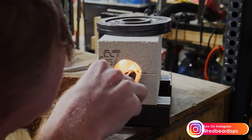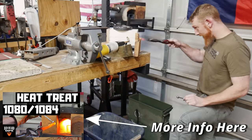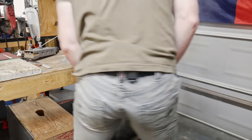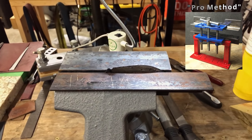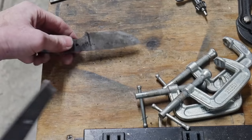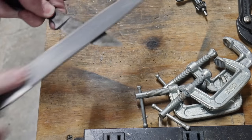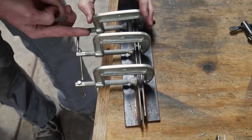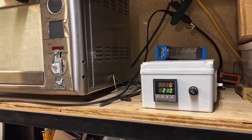To stick with the cheap nature of this knife build, I just used a pair of pliers to hold on to the tang of the knife. I'll get the knife up to a non-magnetic heat and then target around 100 to 200 degrees higher than non-magnetic temperature before quenching it in oil. You can use canola oil, but in this case I use Parks 50. I then clamped the knife between two pieces of angle iron in my vise after a four to five second quench — this ensures the knife cools in a straight orientation. To verify a hard blade, I will file test it to see if the file skates across the blade or digs in; if it digs in, the steel is softer than the file and something went wrong during heat treatment.